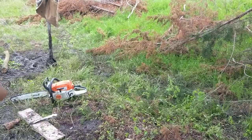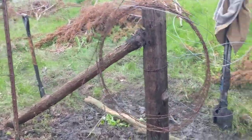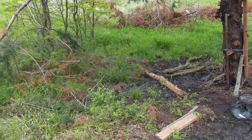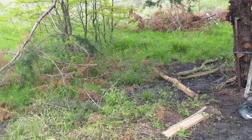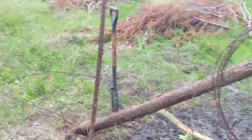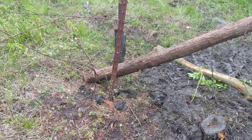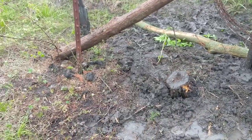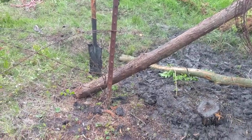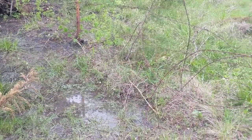From this cedar I dug a hole — a 30-inch hole because this post was only 76 inches long. I tamped it back up. From here to that cedar I'm going to create a wire gap like I showed in the last video, so I can let the cows come in from here instead of going all the way to the back. From here I'll pull wire with a little floating brace — I'll dig a small trench, put a brick or something at the bottom so it doesn't move, and throw a line of wire at the bottom, tightening it up real tight.